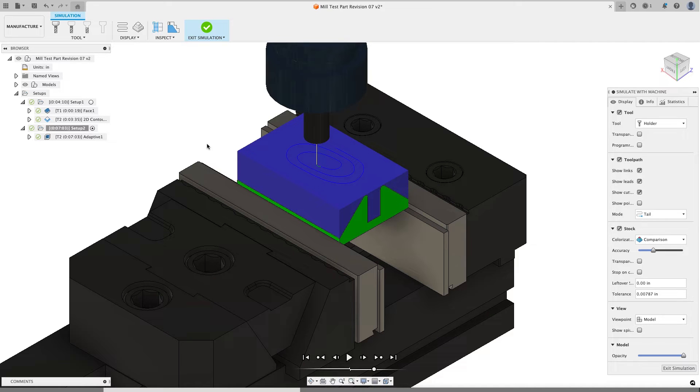Now that the material is gone, I can create a new setup and probe off the actual X-Y faces of the part that are nicely machined. If you have a machine with a probe you could do an in-process probing operation here — everybody with a paid Fusion license has access to that without creating a new setup. If you're like me with a Haimer or edge finder, you need to create another operation. That's all I'm going to do for the second setup, and I'll exit the simulation.